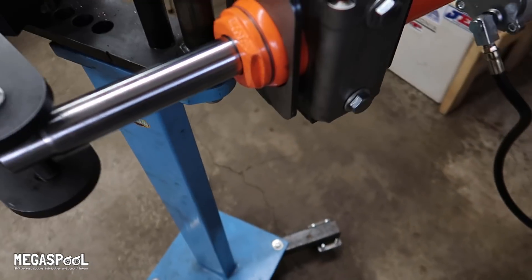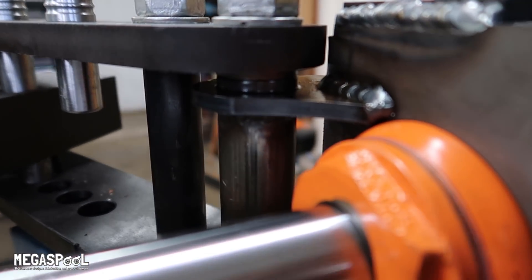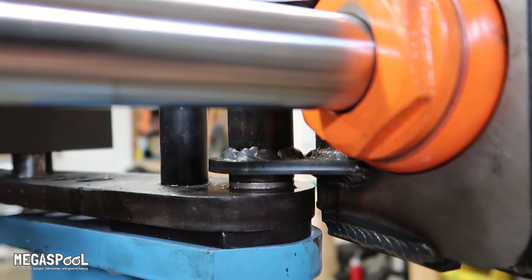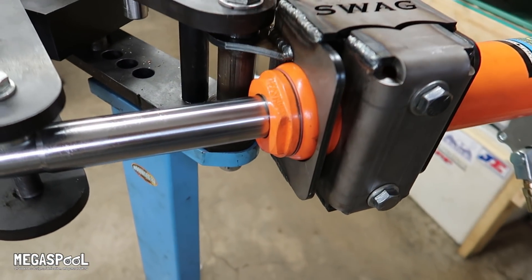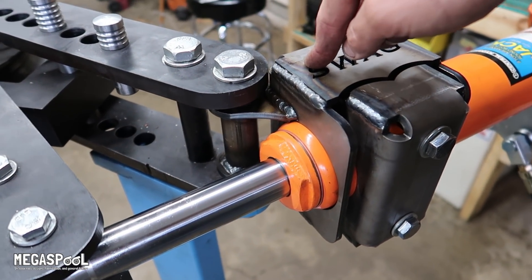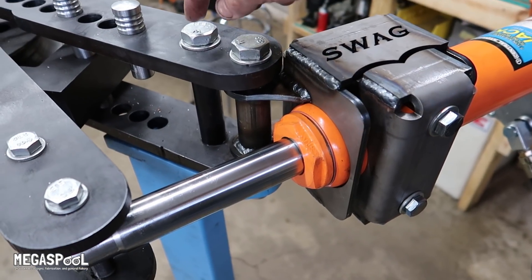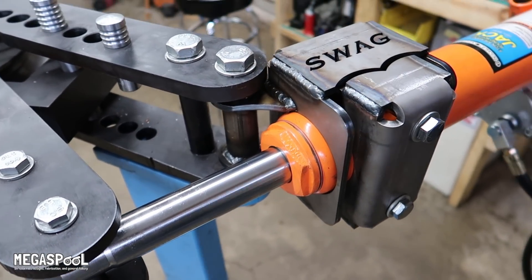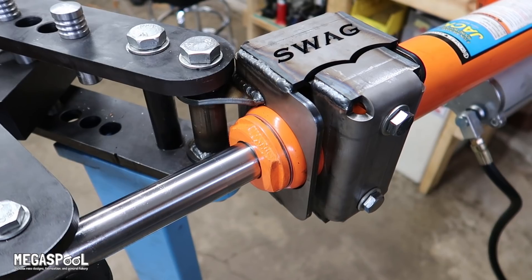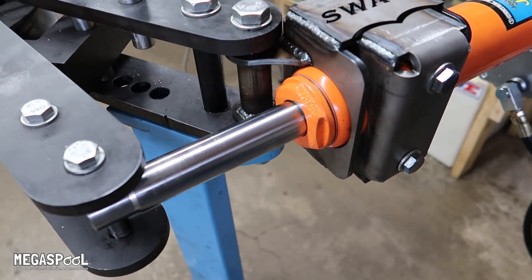It's put together. I had a little bit of trouble with the bronze bushings that go in here. There's a bushing right there that goes inside that collar and a bushing right there that goes inside of that. They were too thick — when I tightened these two bolts up, it wouldn't let this rotate at all. I mean, I beat it with a hammer and it wouldn't rotate. So I shaved them down a little bit. Maybe if Swag ever sees this, they could tell me what I did wrong. But it's together other than that.